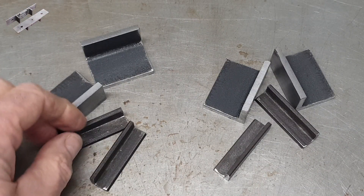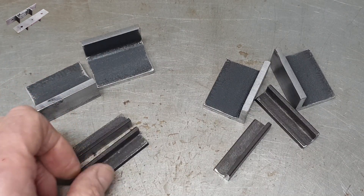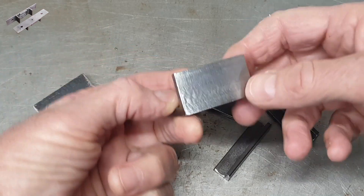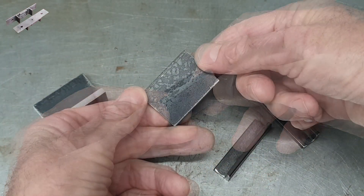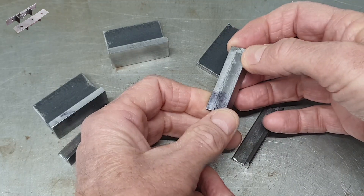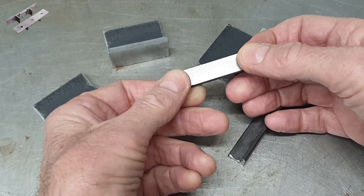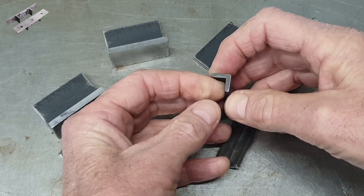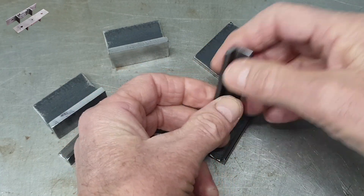For each of the buffer beams there are four brackets that need to be riveted in place. Two are for the main frames — that's the larger of these brackets here. The smaller ones, actually I'm not quite sure what they are for; they go across the middle, top and bottom, maybe just to give it a bit more rigidity. All of these have been cut from angle iron to the appropriate sizes — the larger ones are 5mm thick and the smaller ones are 3mm thick.